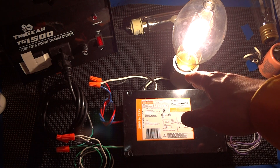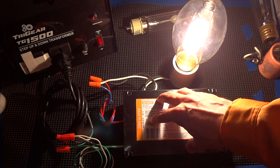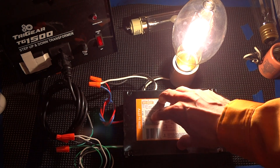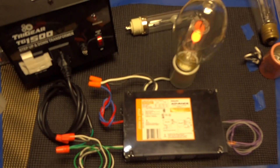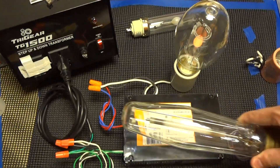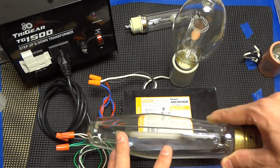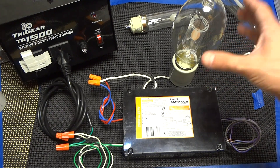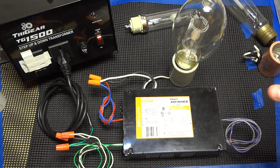You can get away with taking about 80% of the heat away with just an air cooled hood, and you can use it in your standard air cooled hoods that you already have set up. You can actually see the arc tube is nice and red. The benefit of ceramic arc tubes versus HPS is that once you turn the ceramic light off, the infrared being output is actually a trigger mechanism for plants for flowering — if they're in flower stage, it triggers an extra hormone to further pursue flowering.